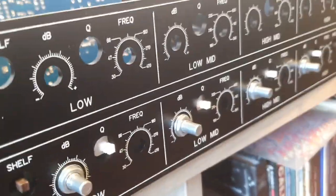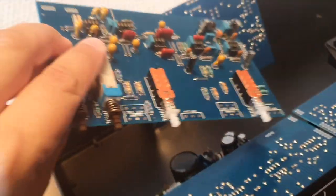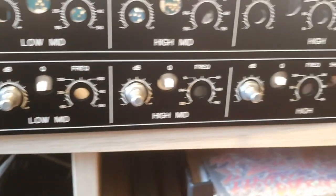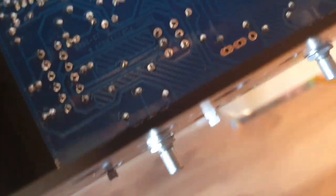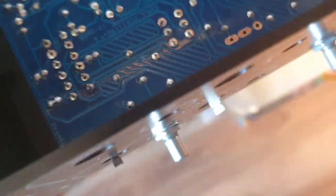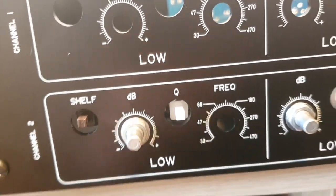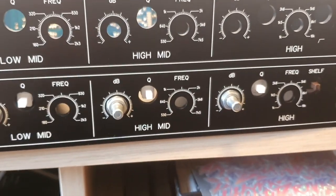So pots are screwed in, and since the switches are already here aligned properly on the board, everything's gonna have to line up here as well. And I also have been thinking that the boards are currently just resting on the pots at the moment. Before I do any soldering of the pots, I need to have the buttons here as well, and have them properly seated on the buttons. So when I have the caps, I'm gonna do the final soldering of the pots.